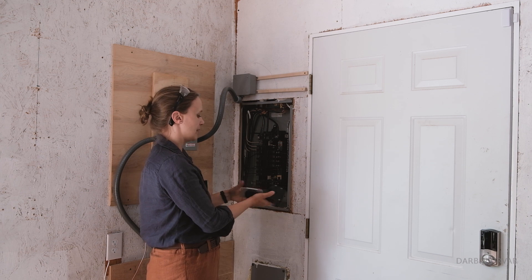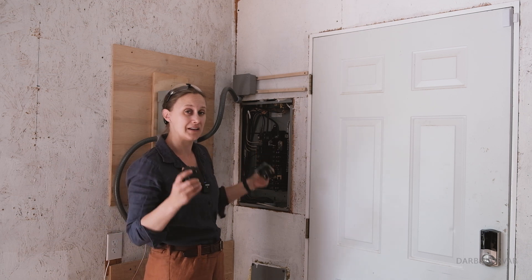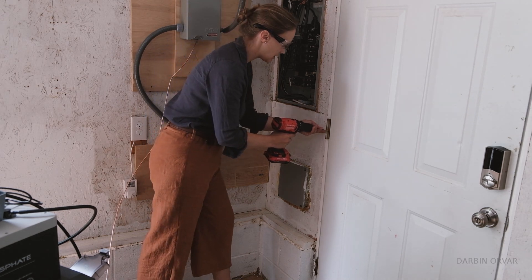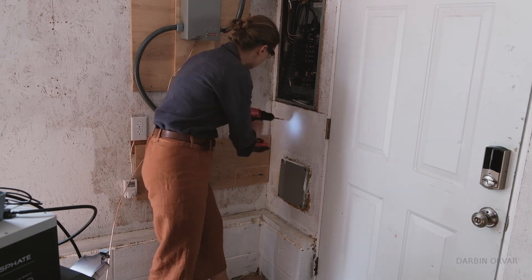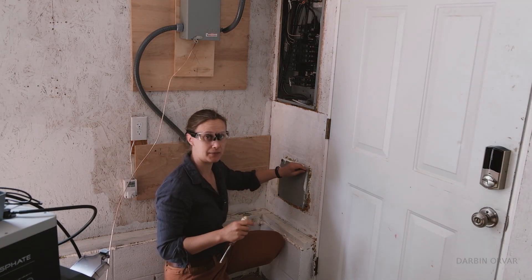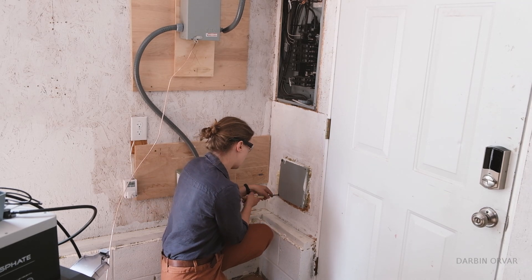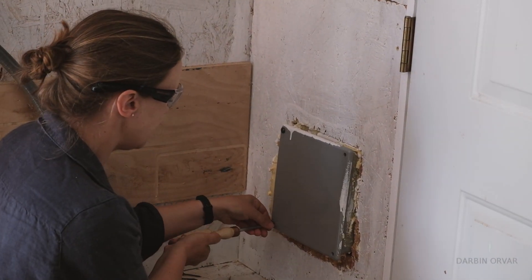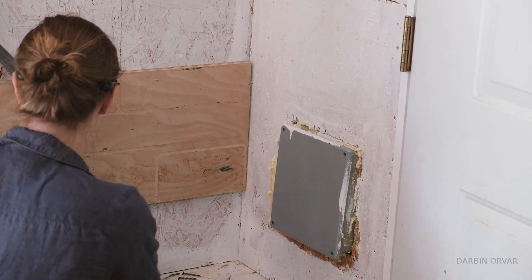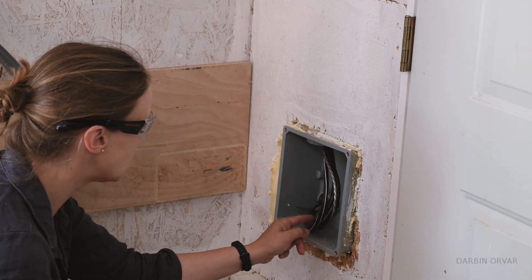Then we're going to feed that wire down — I'm going to put this outlet in the box right here. You could put this box wherever you need it. I'm going to put it right here because that works for me. Now it might be worth saying that I'm not a licensed electrician, and if you're not comfortable doing this you probably should not. That being said, if the power is off and you're careful, it's not that complicated and it's not that many parts. This is where the main power is coming in to the house — two hots, one neutral, and one ground.